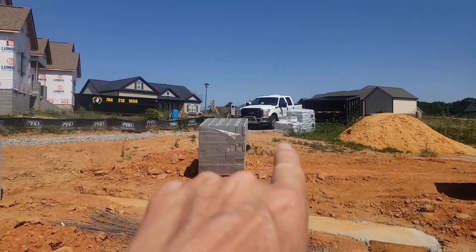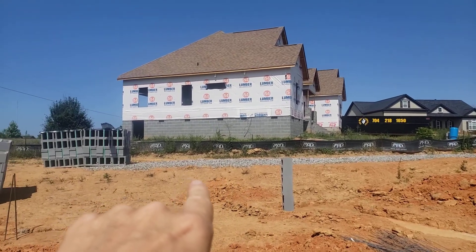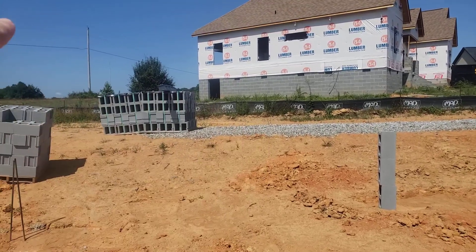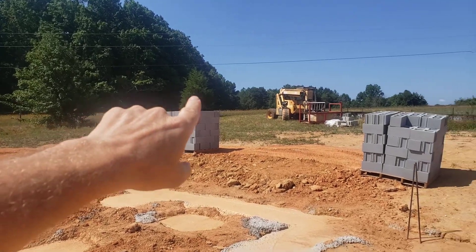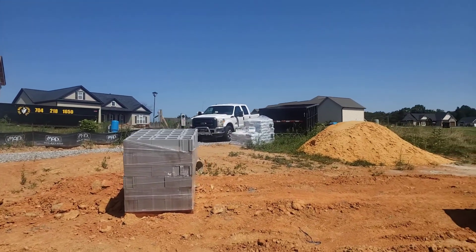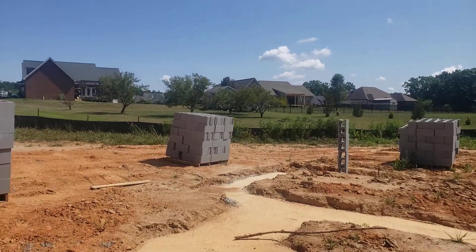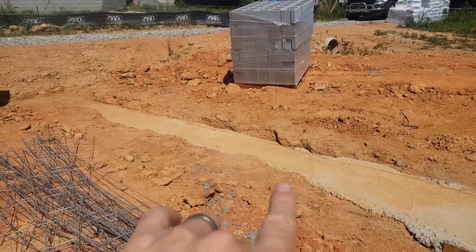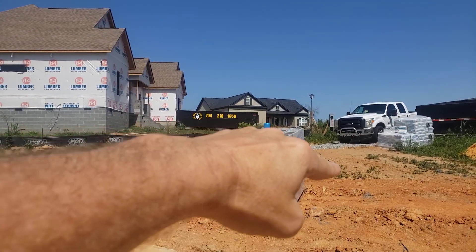Now there are some issues here. The road is up there. There's our temporary driveway, and our driveway has to be at that height — you can see how we're kind of down in a hole. But it has to be that way because when water comes down here, we can't direct it around the septic field — that's a no-no. So it has to come here, go over to the driveway and out this pipe here, out that culvert, and follow along down the low side of the property. However, that culvert is higher than this footing, so we're going to have to build this foundation wall up high enough so we can slope dirt and direct the water that way.